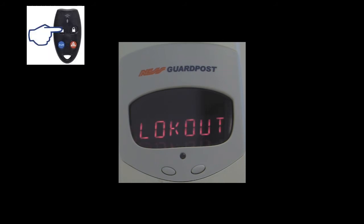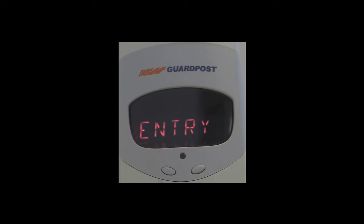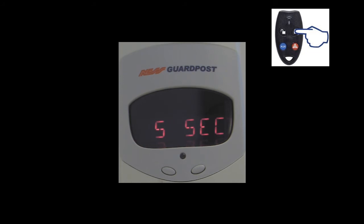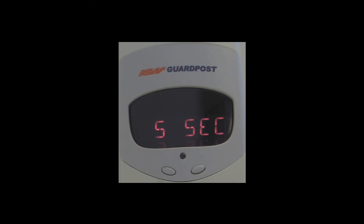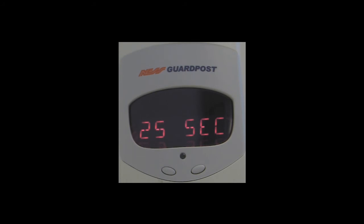Pushing the off button on the radio key takes us to the next option, which is Entry, or entry delay time. The entry delay time allows you time to disarm the system once the detector is activated. The SG3 is normally armed or disarmed by a radio key from outside the protected area, but in some instances you may want to disarm from inside the premises. If you wish to adjust the entry time, pressing the on button takes you into the settings, and subsequent presses cycle through the sub-menu, which is adjustable between 5, 10, 15, 20, 25, and 30 seconds, and back to 5 seconds as default. Once you have set the time you wish, pressing and holding the panic button will save your setting.